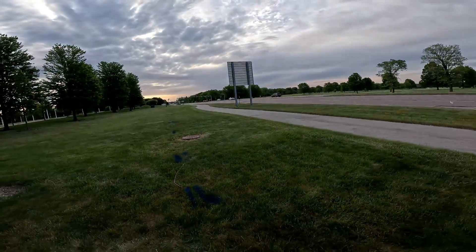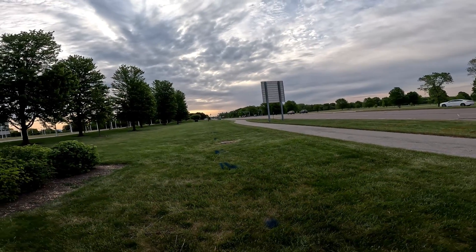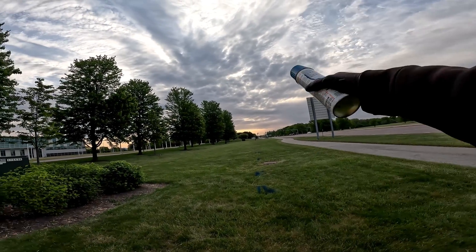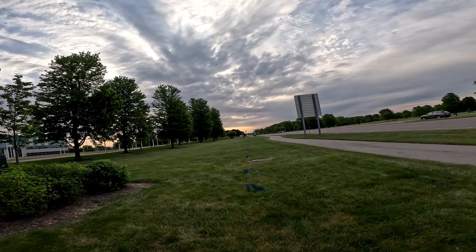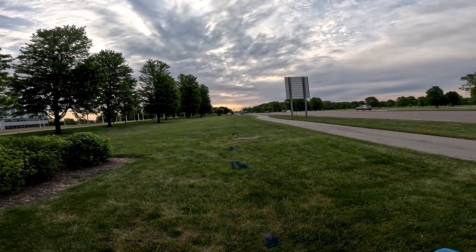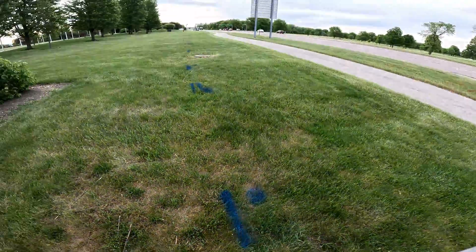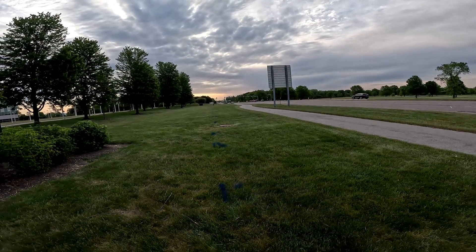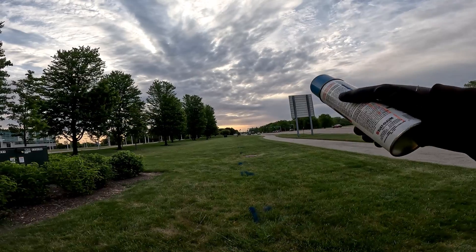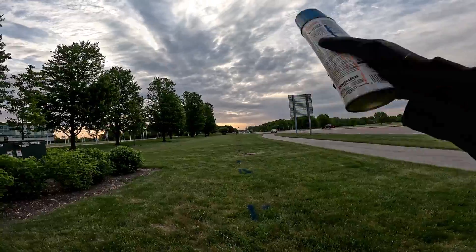You just have to make a little adjustments after you mark it out, and stand back and look and see the straightness — because the water main will run straight. You can see way down there by that fire hydrant, another valve, and it looks like it's lining up pretty good. Now it's nice and straight. Let's see if inside the valve it's offset to the left, and it lines up.